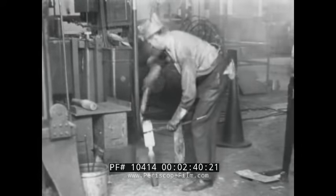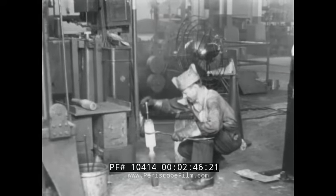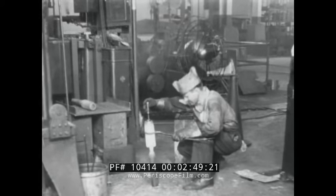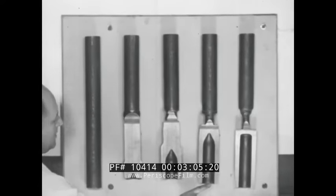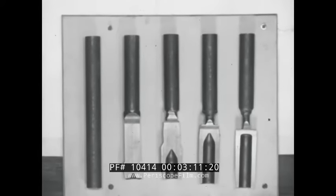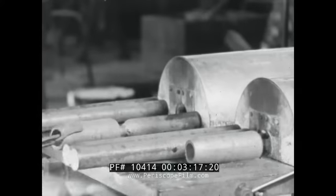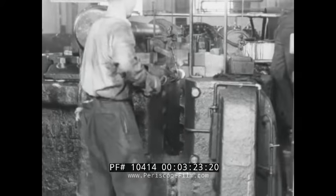The interior cavity of this forging is finished to the finished drawing dimension size. This is the bar before heating. This shows the cross-sectional shape of the bar after passing the first station, the second station, the third station, and the fourth or final station. The opposite end of the bar is next heated and forged in the same manner as was shown in the preceding views.